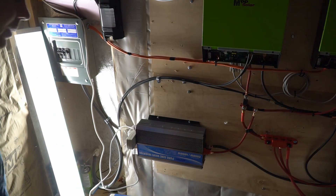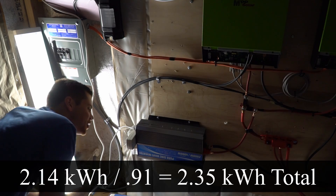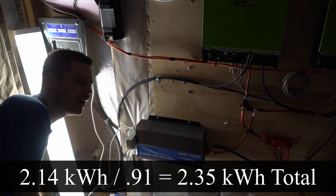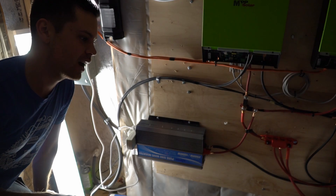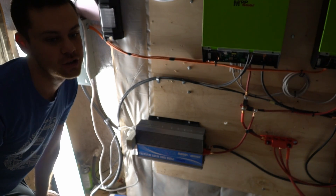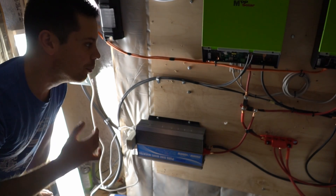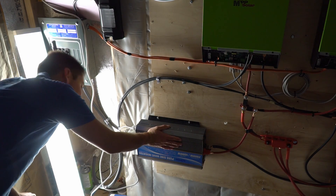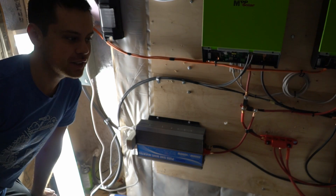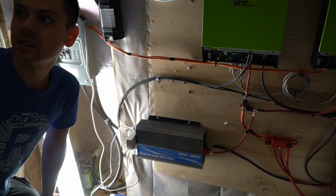It's been 24 hours — 2.14 kilowatt-hours. To be fair, yesterday was 98 degrees Fahrenheit, not 100 or 101 like the previous days. But it was super hot all day long and we only used practically 2 kilowatt-hours. That's a huge improvement just from insulating the door.